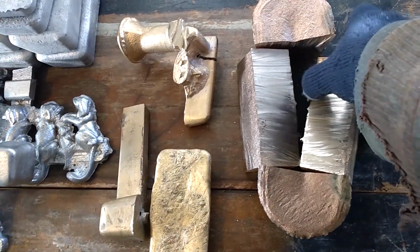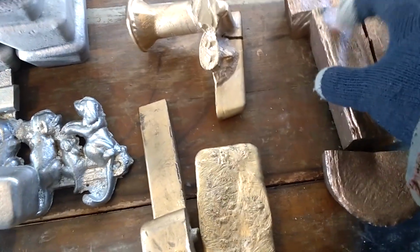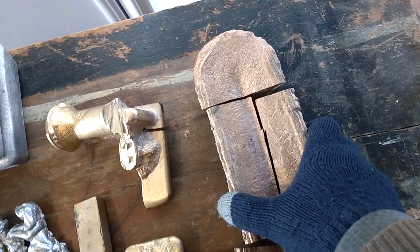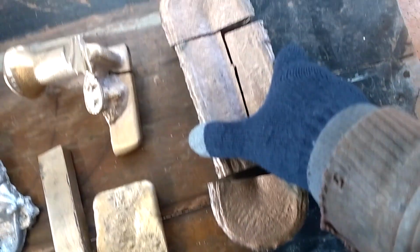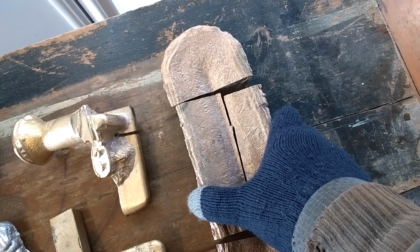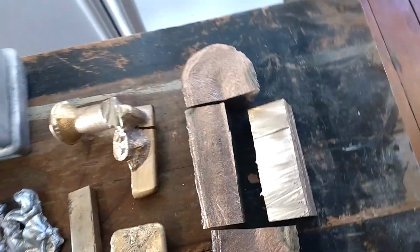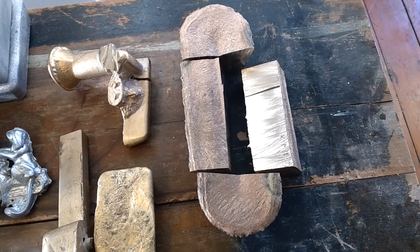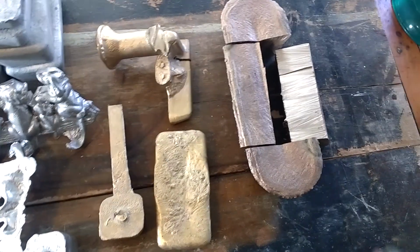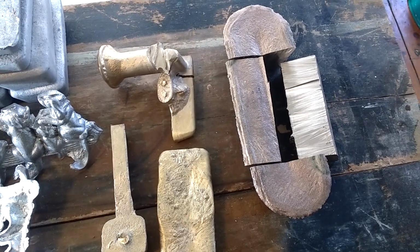Like the silicon bronze. If you look at the surface of this ingot, you don't see any foamy bubbles. It's smooth, except for where I cut it. Much nicer to work with, and that's why it's favored by people who cast things like statues and whatnot. Of course, there's yellow brass for decorative stuff, but anyway, this stuff should be less difficult to get good results with.